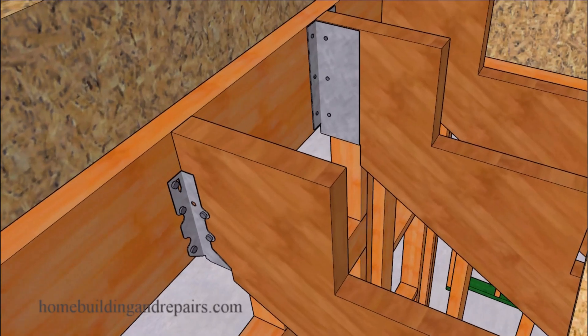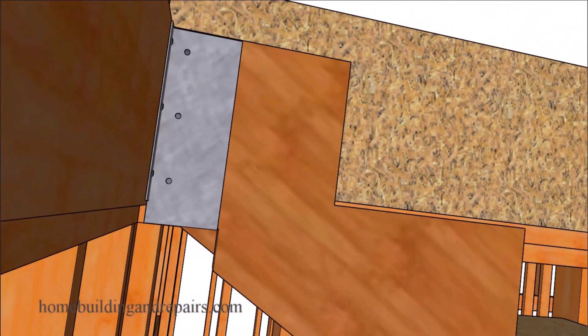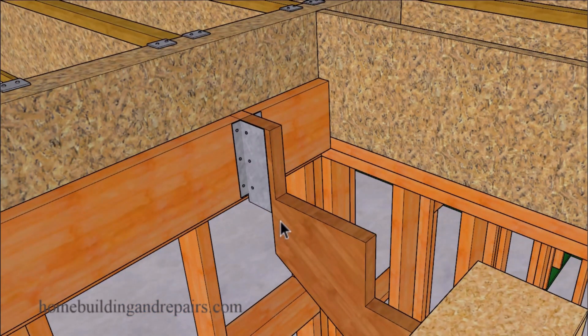But that's not the reason why I made the video. Even though I don't see it very often, I do see it every once in a while — and that's the fact that some of you are using larger hangers. The toenail connection doesn't seem to be as good as using a floor joist hanger, and if the floor joist hanger is better than toenailing, then what would be the next best thing? To use a larger hanger. And I'm not about to suggest you're ever going to have a problem with cutting two or three inches out of the bottom of a stair stringer unless it looks something like this. What we have here is an extremely weak connection, and to solve this problem, all we need to do is have a longer ledger and then maybe use the nailing method or the smaller hanger.